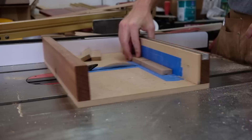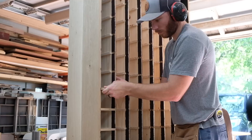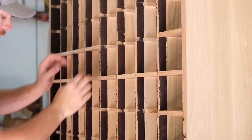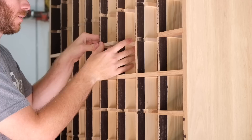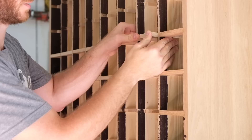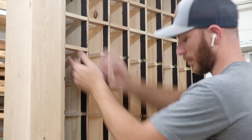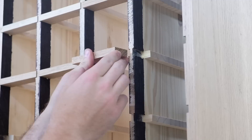With the cabinet glued up, I can cut the front and back horizontal dividers. These are about an inch and a quarter wide and fill the remaining space that the runners left open. The back pieces are pine, and here you see me getting all the oak pieces set up in a dry fit — I wanted to make sure everything fit nicely before adding glue. With compounding errors, I needed to make sure these all fit together. There are 72 of them, so things can get out of hand quickly. It's easy to fit a divider in that's a sixteenth or an eighth inch heavy because the vertical dividers have some bend, but once you get a bunch installed that error adds up and you're left with the last few spaces being too short.